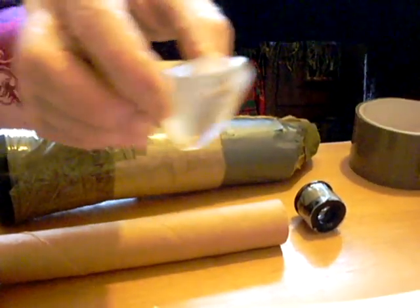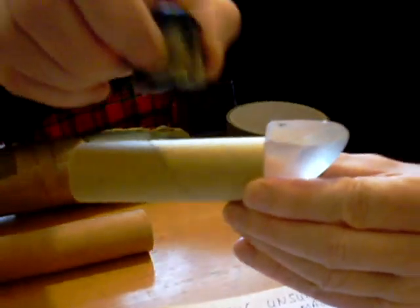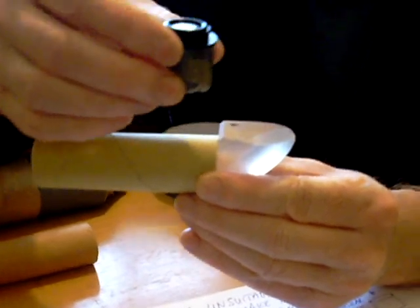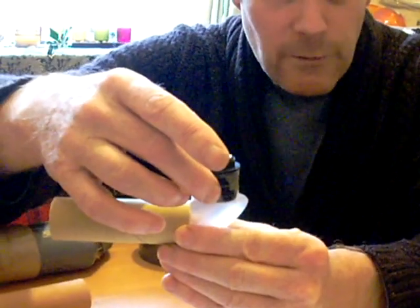This angle here is the critical angle, which is 45 degrees for the prism. And on the top of the prism, that's where I would encase a binocular eyepiece, which I've taken out. You might need a very small screwdriver to get the old binocular eyepieces out. And I make a nest for it on the top.